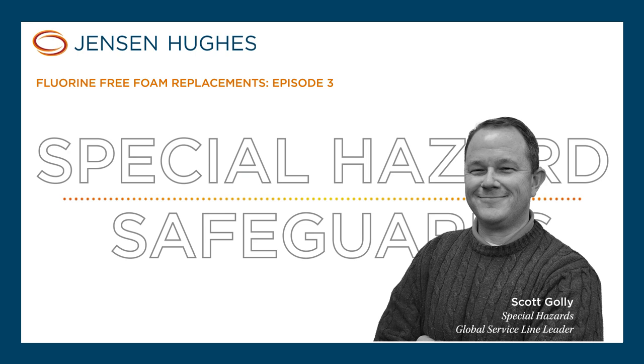We really want the product to expand because that's how it best suppresses. But in the same respect, we also get higher burn back there. Burn back varies significantly between product types when we talk about Newtonian versus non-Newtonian. A lot of the products that seem to be UL 162 listed are Newtonian. Non-Newtonian provides an additional three to five minutes of protection, but there may be some more complexities in how we pump and move it, so the hydraulics in the system become really critical when we assess a non-Newtonian. These are PFAS-free foams — they provide protection from Jet A for three to six minutes, or three to four minutes on gasoline.